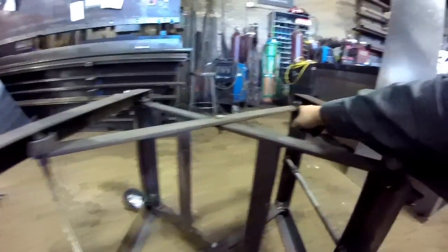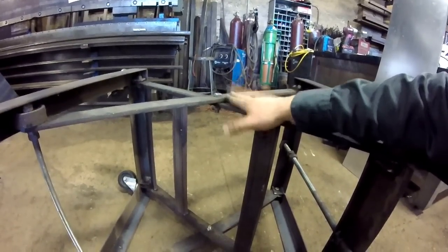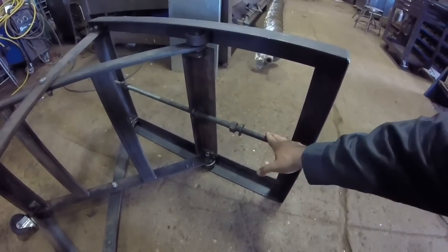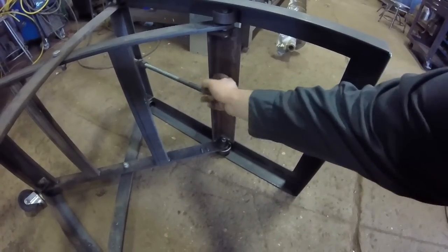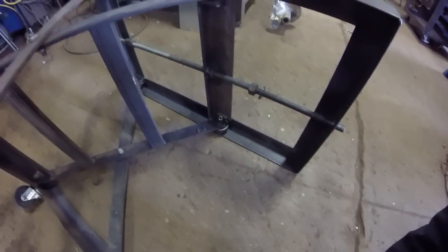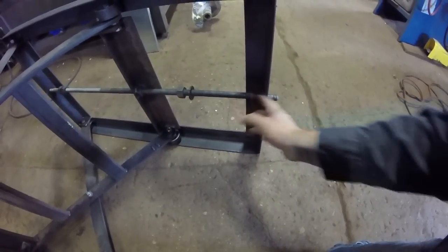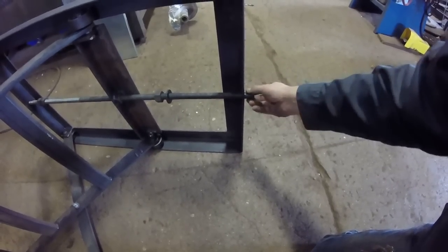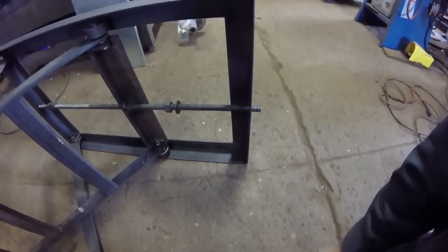The spacing of the pads was based on how big the cross bracing X was. It's a very simple mechanism. I've got a three-quarter inch all-thread and a three-quarter inch heavy wall nut welded to the angle iron — that's what's attached to the wheels, and you can see all the linkage and bolts there. I was planning on having retainers that weren't tightened, just so it could spin freely and retain on the angle, but it doesn't even need that. This thing's been operational without them.